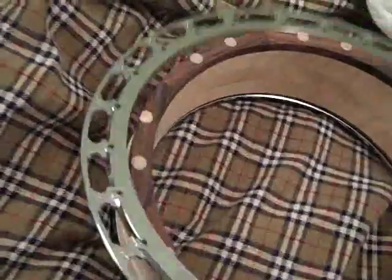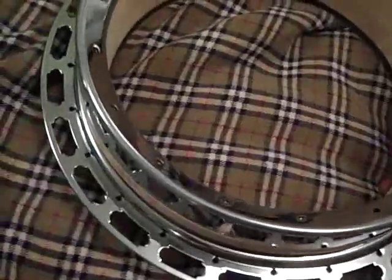Here's my rim that I made using my circle cutter with my router — I did all of it with the router and sanded it. As you can see, it fits — the tone ring fits on there nice and snug, and the resonator flange goes on just like that. So there you have it, it's possible. And as you can see, I have my resonator all carved out now using my router, my circle cutting jig, and those block templates that I made.